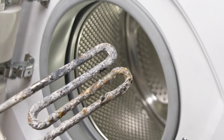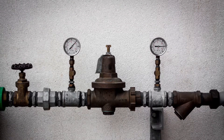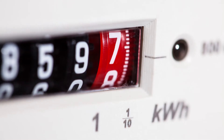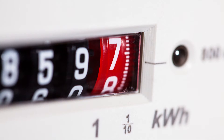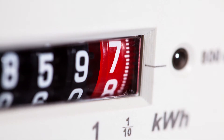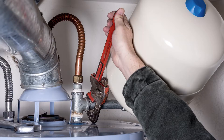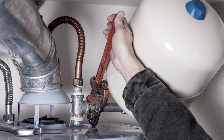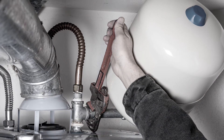We replace the washing machine, the dishwasher and the shower glass. We pay for the repairs on the hot water system and air conditioner. We pay the extra energy bills, as for every one millimetre of lime scale build up on the element in the hot water system, it costs an extra 10-15% to heat the water. And in the end, the water does not even get hot as the element is working overtime and does not contact the water.